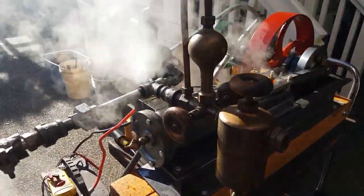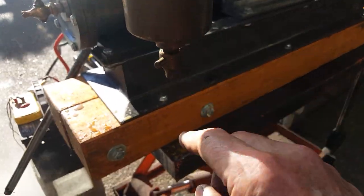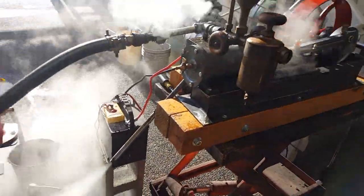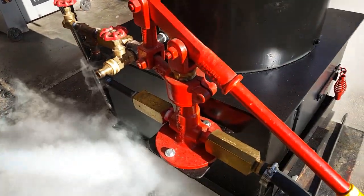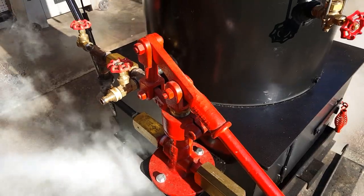This thing really gets hot, so watch it. This is your water drain at the bottom. Make sure that water drain — all your water is drained out in the winter especially. Same with the pump — if it's freezing out at all, take this one off and drain all the water out of the system so it doesn't freeze.